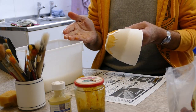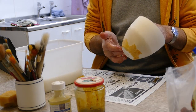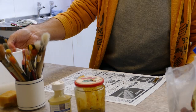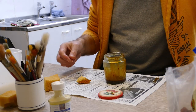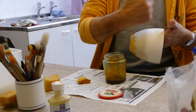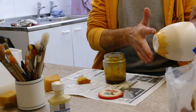Normally if I had half a dozen pieces on the go, this piece would now get put to one side, the next piece would be sponged, and so on until you've finished them all. They then need to be allowed to dry — several hours or overnight. Then once again you take out the shellac and apply another layer just to this edge here, all the way around. You can then take another layer off, so you can work your way up through the body of the piece until you've got as little or as much taken away as you want.